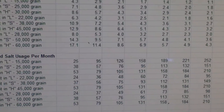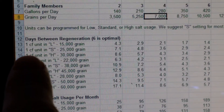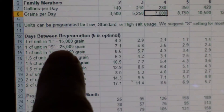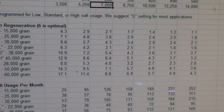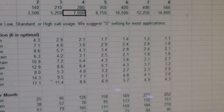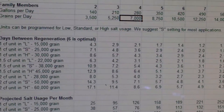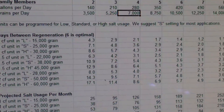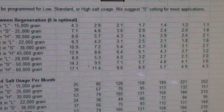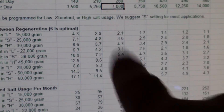From our earlier calculations, using 10 pounds of salt per regeneration gives a capacity of 26,000 grains. I'll use one cubic foot at a standard 25,000 grains for a conservative estimate. With four people in the house, days between regeneration comes out to 3.6, but since our water isn't that hard, we'll round up to four days.